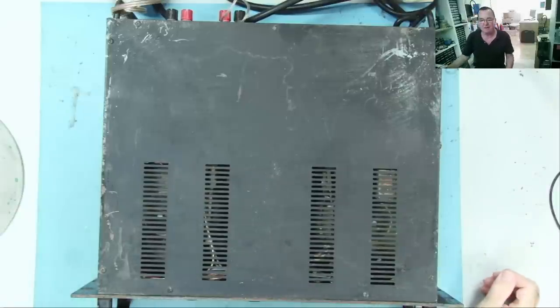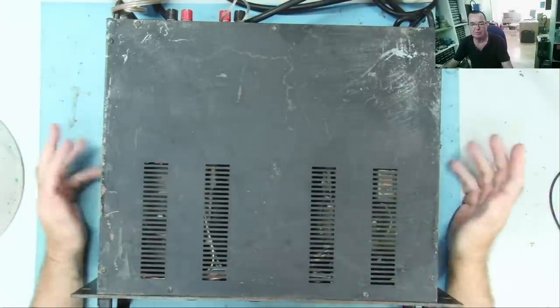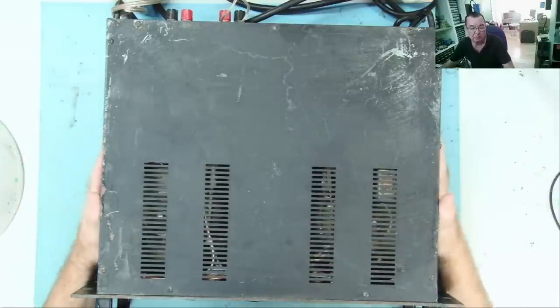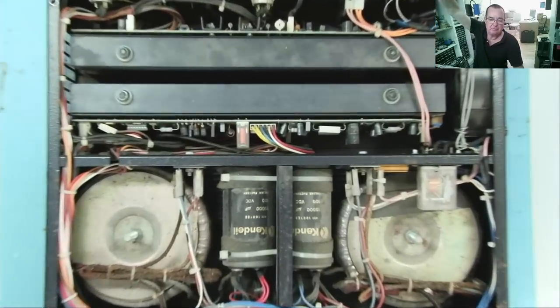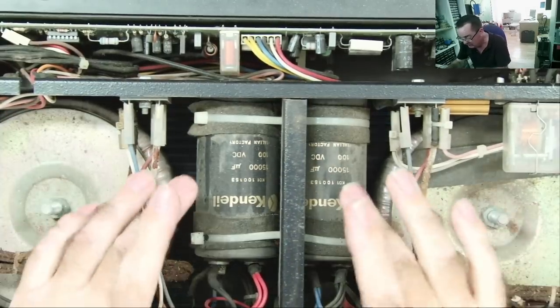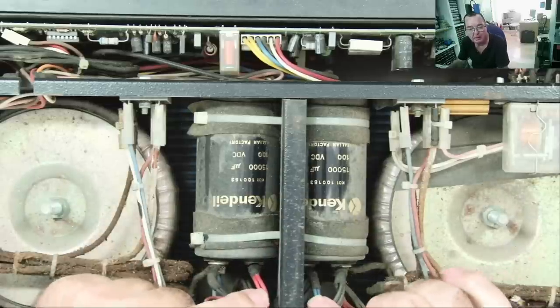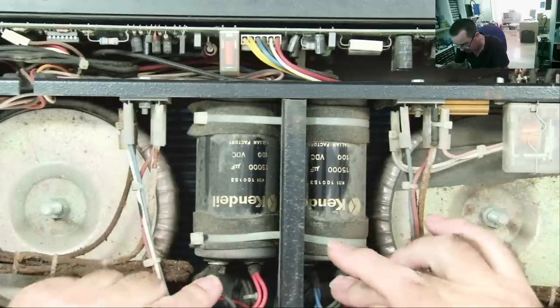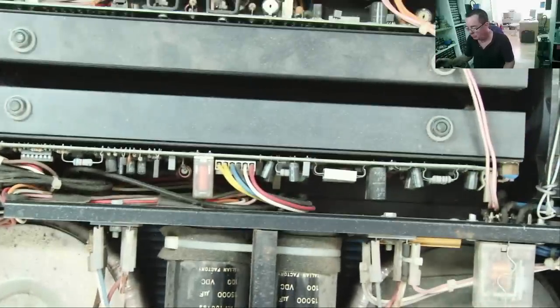You can hear the weight of that. So as always with these amps, I open them up and have a look first to see what I may see, and then we can work out what we need to do with this one. And there it is. Two very large pork pie transformers, four extremely large 15,000 microfarad 100 volt capacitors — that can certainly give you a very nasty shock. We have plus and minus here. One relay here.